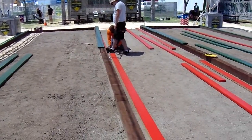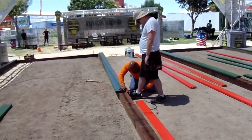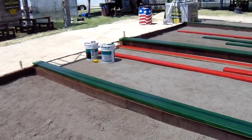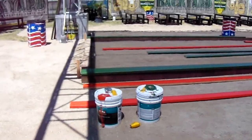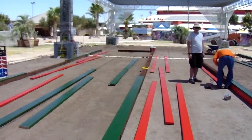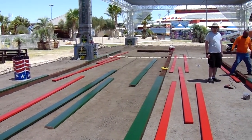The timbers are somewhat uneven, so it's making putting our finished trim on here a bit of a challenge. We wanted a green cap and a red side, and it's not as true as we'd like it to be. So just one thing to keep in mind: if you're building a bocce ball court and it's going to be a la naturelle, the timbers are okay, but if you're looking for a real fine finish, you're best off going with conventional lumber and treating it at the job site.